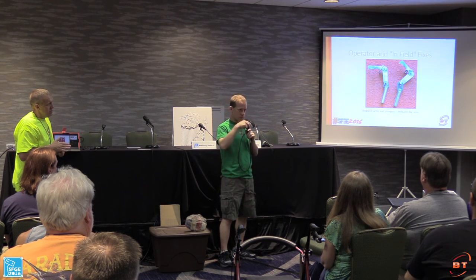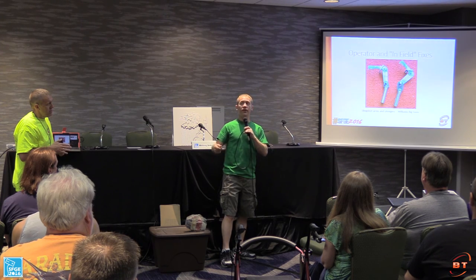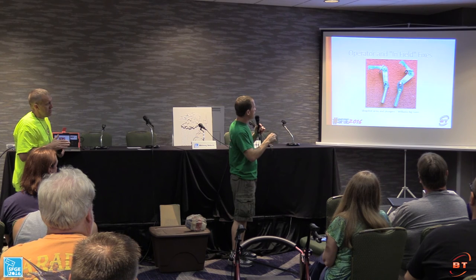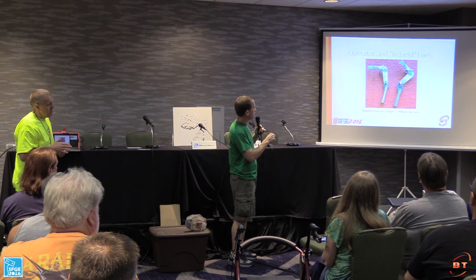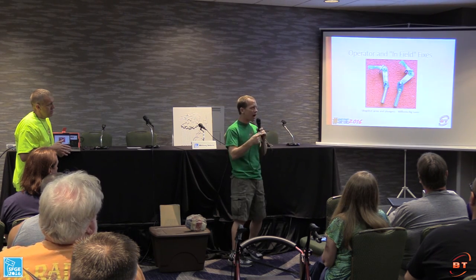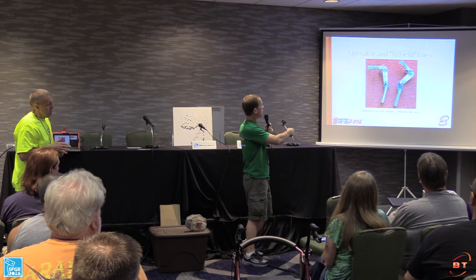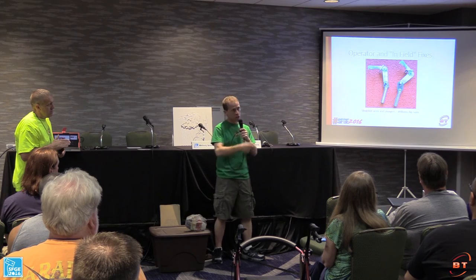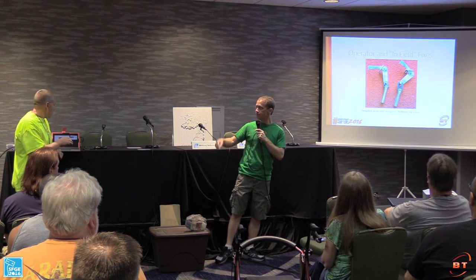And then I started, in this particular game, doing more stuff, and then there were more little gremlins hidden in there. But if you notice, there's a lot of gap in there because it's a bigger lug on a flipper link. The geometry is just wrong, it's sloppy. It's a couple-cent part, but when this was in the field sometime, whenever, they probably just had a flipper link. They changed it, and they were making money.